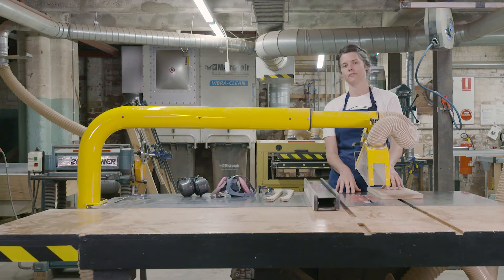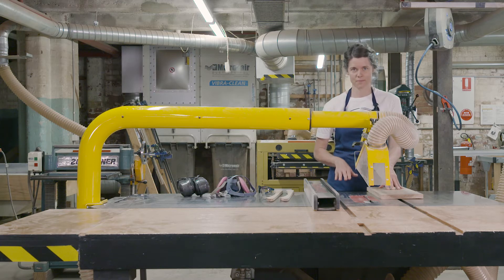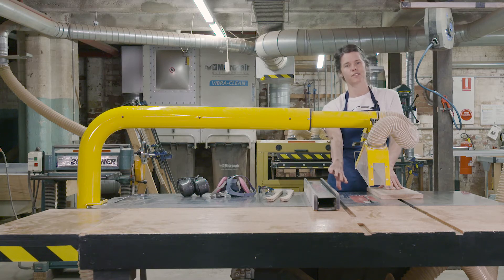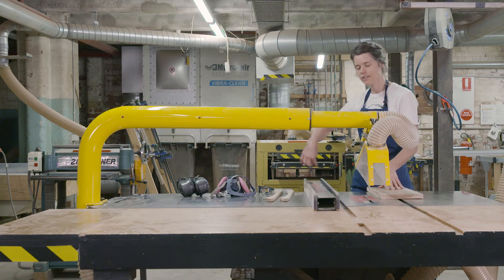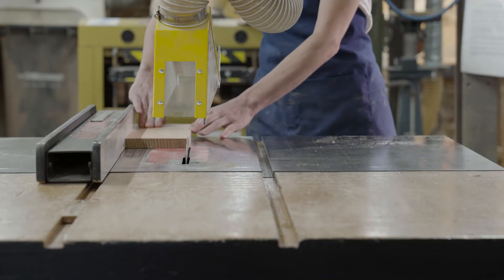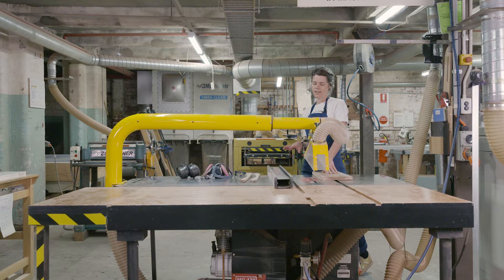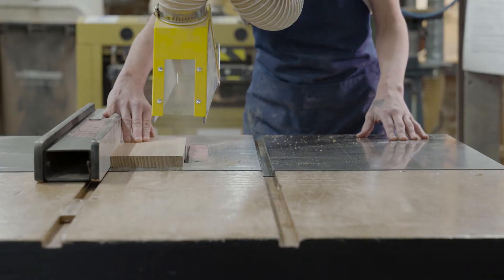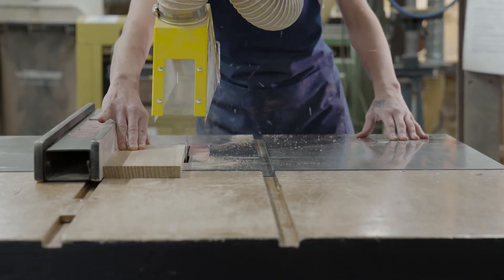There is the possibility of kickback, with a piece of timber being pushed through the table saw. The riving knife largely prevents this, but in the case that it does happen, it would fly directly backwards. So it's always a good idea to stand just to the side so that you're not in the line of fire. In addition, you never want your hand directly behind the blade — make sure that if you were to slip, or the piece slips forward, your hand is not going to go into those teeth.